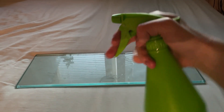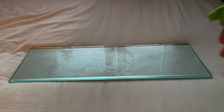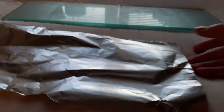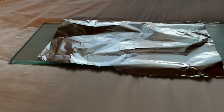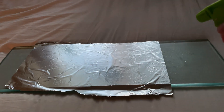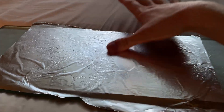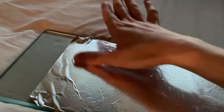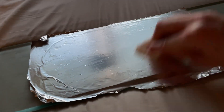The next step is to laminate the aluminum to the Mylar. Something to keep in mind when gluing is to glue the aluminum's smoothest side to the Mylar. To avoid air bubbles, you should smooth it out with your hand and preferably not a card, because you can rip the aluminum — small bumps like this one can get torn up when run over by a credit card.